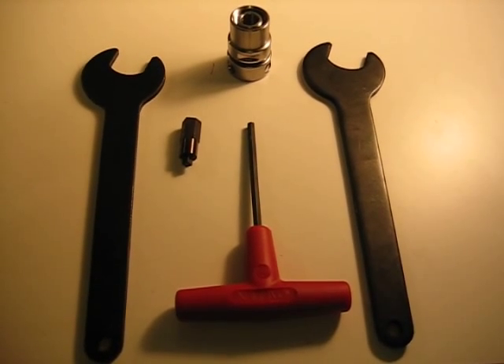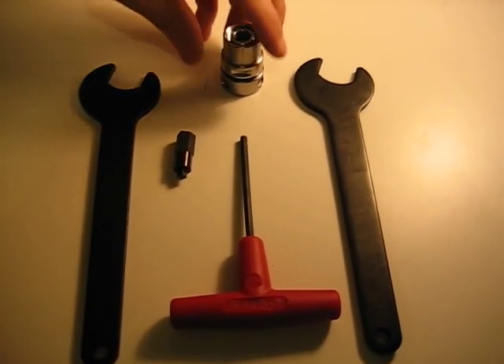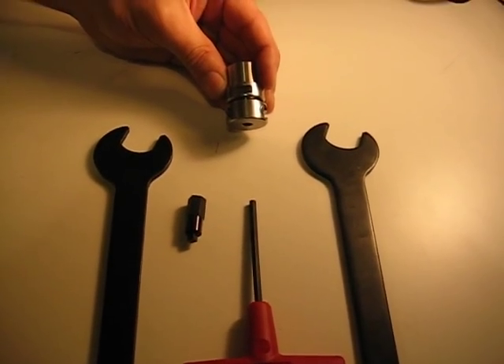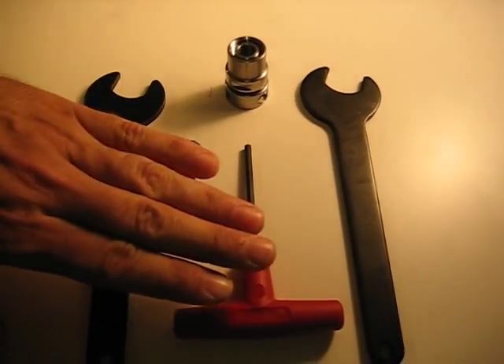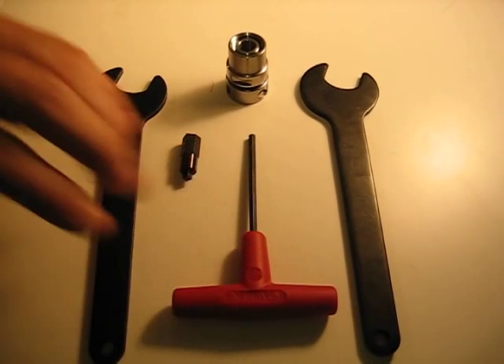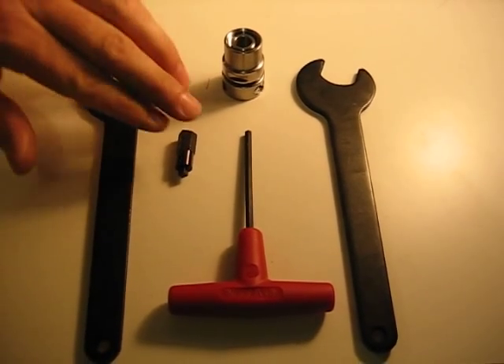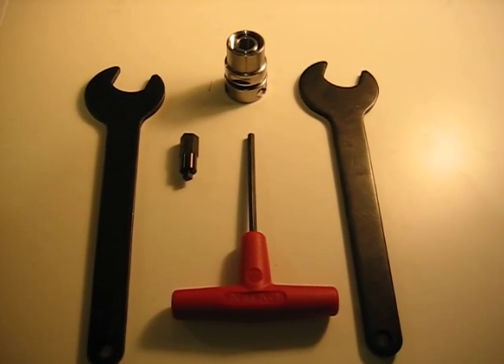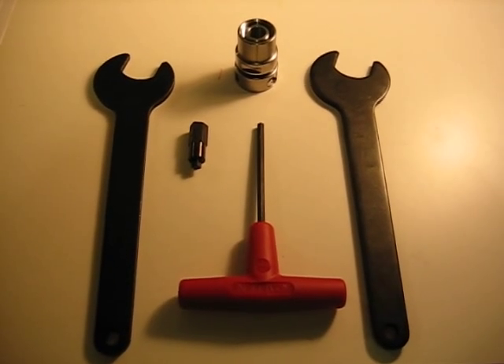This shot shows what is included in rock kit number one. Included are the following: the rock chuck, which consists of four pieces; two thin wrenches; the tightening and loosening T-handle used to remove and replace the tools in the chuck; and also the square bit adapter used to hold the spindle during assembly and disassembly of the chuck from the machine.